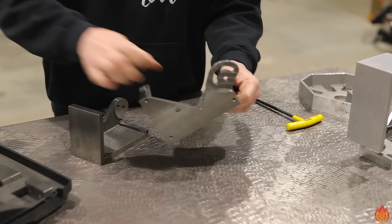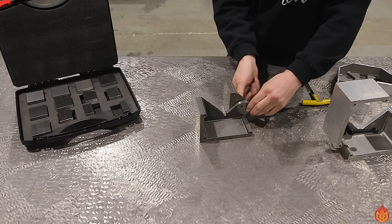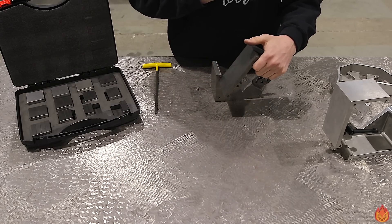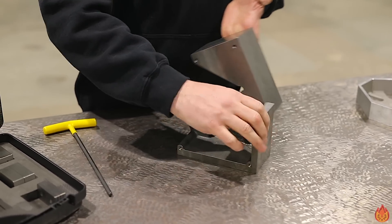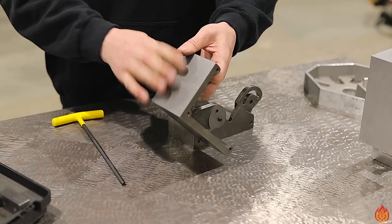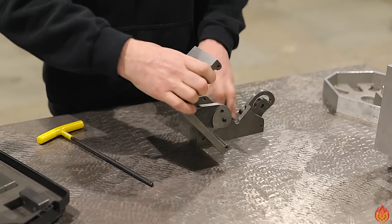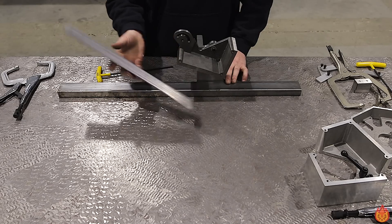I've included this little hole right here — it seems simple, but what we can end up doing is combining the squares on a different offset. We can take the pivot pin out like this, and what we end up with is instead of an offset 90. So let's say you had a lot of production to do at a weird angle — you could fixture this part of the square down to the table and it stays clamped permanently. Now this side is hinged; you set it at the angle you want. You can roll it this way or that way. Having this 90-degree corner here is a huge benefit — you can pull your material quickly in and out for easily welding, mass producing the same joint over and over, which is handy. Or you can stand it up on this side for a little more clearance.